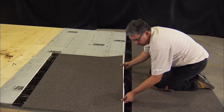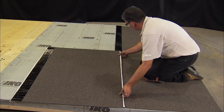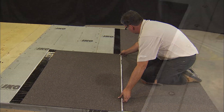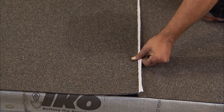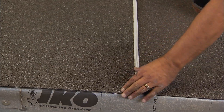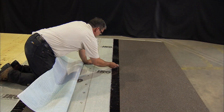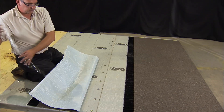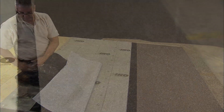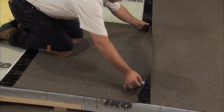In hot weather, it may be best to limit the length of individual pieces of RoofFast to a maximum of 12 feet for ease of handling. Roll out the second cap sheet, cut to size, dry fit into final position, and allow to relax. Ensure the second sheet overlaps the 3.5 inch side lap of the first sheet. Repeat the procedure for installation of the first sheet, remembering to remove the release film covering the side lap on the first sheet. Continue up the roof, repeating this procedure until all surface is covered.